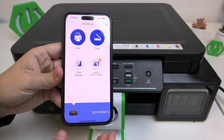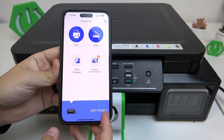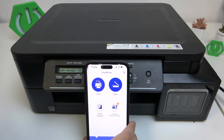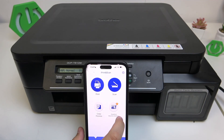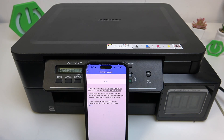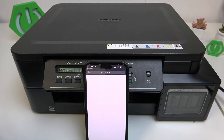Here you will have the printer — make sure that the correct one is selected. Now we need to go to Supply / Machine Settings, and here we need to click the firmware version, then click on Update.